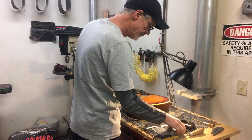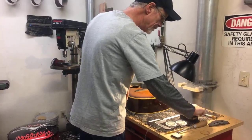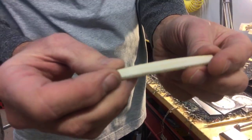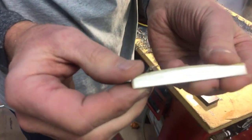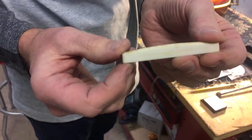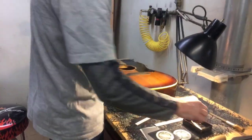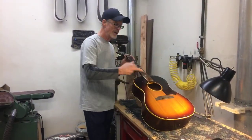The other thing I wanted to make sure of — the bridge has a fairly flat profile, but the original saddle is this interesting composite material. I don't know if you can see the grain on camera — it's some sort of mesh with an epoxy to hold it together. It's a pretty interesting old-school man-made material, but not terribly sturdy; it does have some flexibility too. I'm going to put a new bone saddle in here, and one of the things I want to do with the saddle is match the radius of the fingerboard.